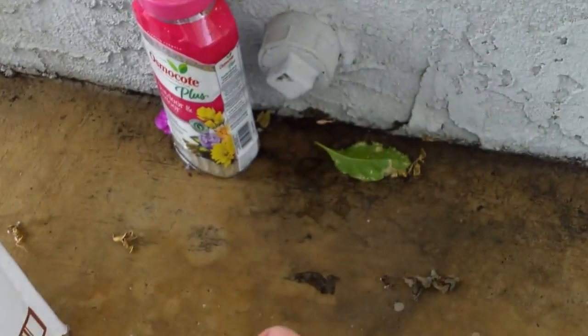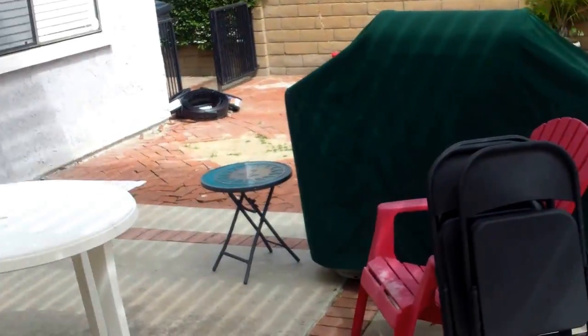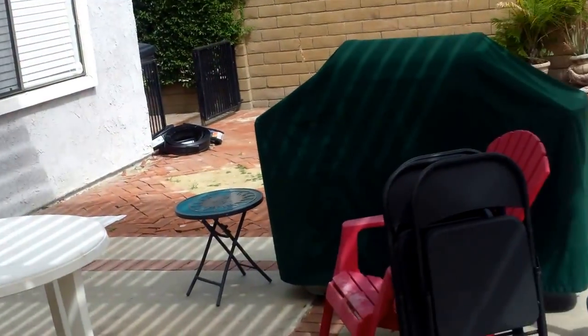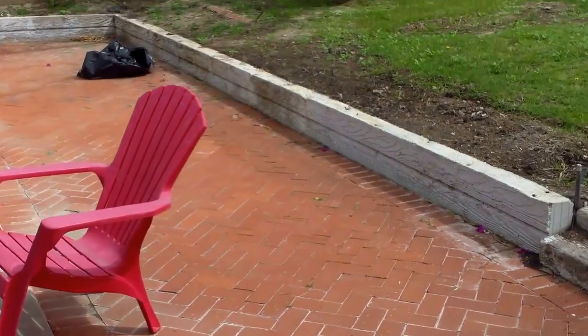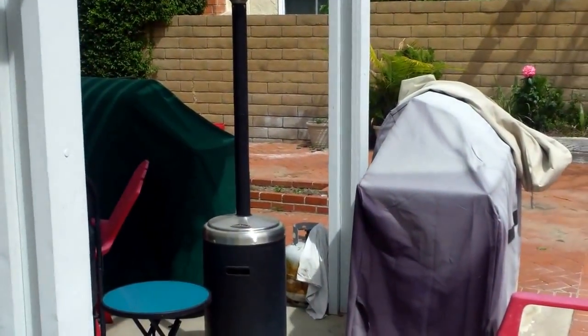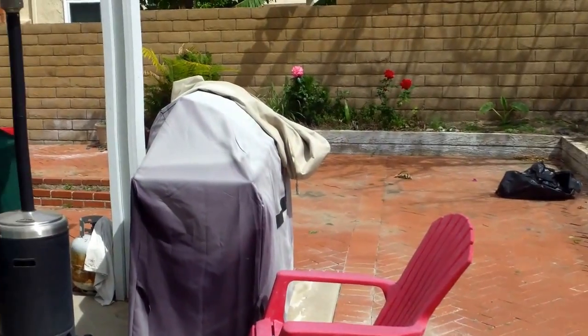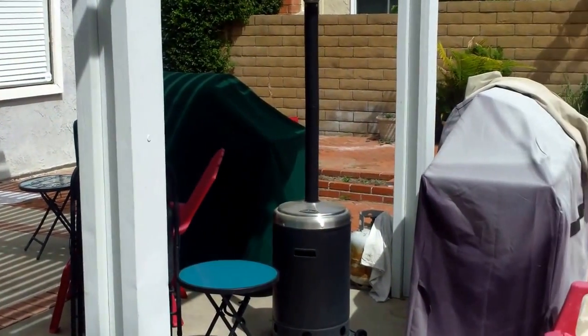The other thing of note is right here. There's 2 cleanouts for the sewer line. There's that guy, and then there's one in the garage. We'll go check that out. He suggested doing a sewer video just to see if there's anything clogging it. And normally it's sort of like a bullet point where the inspector just says you should do this. Usually if there's trees, and there is trees, then I'm more prone to do it. But these houses aren't that old, so it's a couple $100, $200-300.